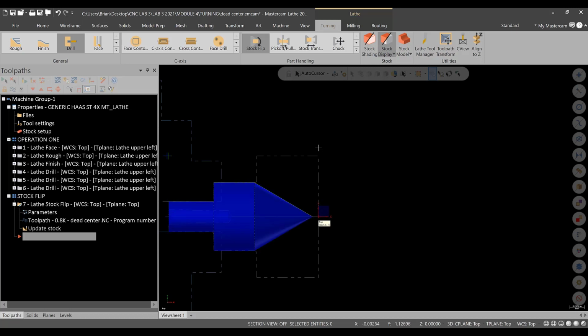So it wouldn't be a bad idea to face this off and get it true, even if you do it manually. Bring it over to the height gauge, measure this distance, and then use that to compensate the numbers. Okay? That way, this makes sense. All right, whatever this distance is, it's up to you. This needs to be accurate, is what I'm trying to tell you.